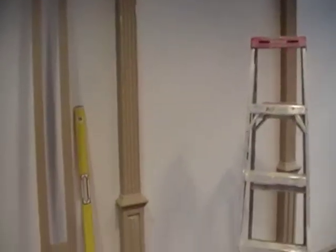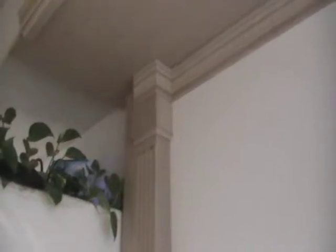And this is our art wall with the columns. The baseboard is about eight pieces, has a flute in it. And then we've got a little four-inch base there and two-piece cap and panel. There are four pieces of moldings there — hand fluted, everything's handmade. Crown wraps around the top. And that crown will dead end around the other return column on the fish tank canopy and bottom. It'll wrap around and the crown molding will wrap around and die into a flat panel to the left.